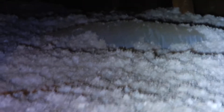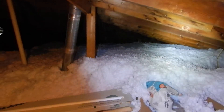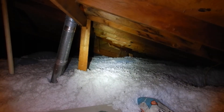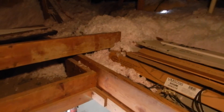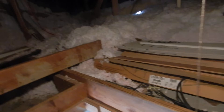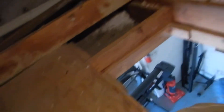Look what's peeking up like the Loch Ness Monster — that's gray sheath air conditioning duct, manufactured by Corning in the 1980s. It was recalled; there was a big class action lawsuit that's been settled with no money left. All the insulation has gone off of it right there — it dries up in an attic environment, peels off, and you lose your insulation qualities. All of the air conditioning supply duct needs to be replaced.